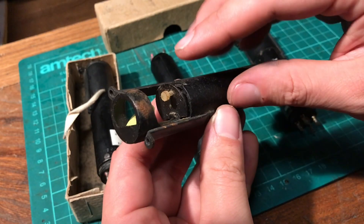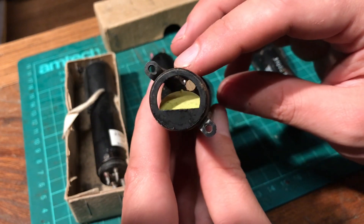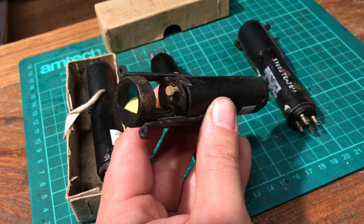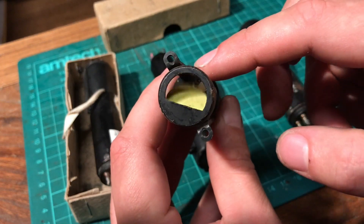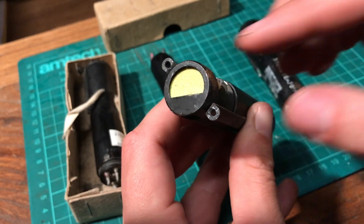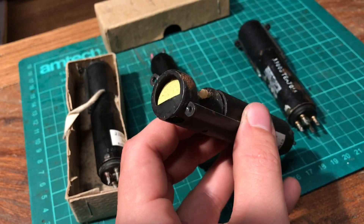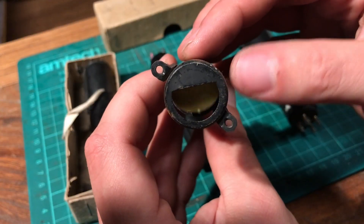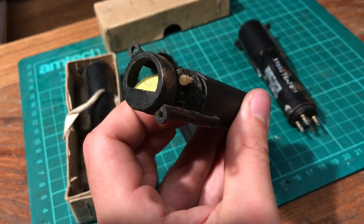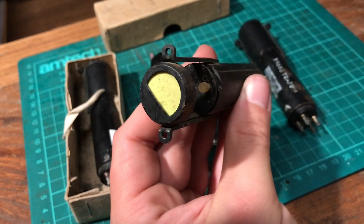So what does it do? This one is partially deconstructed. If I move this little bit, you'll see - it looks just like one of them flip dots, doesn't it? Except these were used in the 1930s, so they're 1930s flip dots. Now actually it's called the supervisory flap. The supervisor was the telephone operator, the telephonist who was in charge of the manual switchboard. These indicators tell you when there's a call in progress. They didn't work with a finger - they worked automatically with the electronic terminals on the back, switching themselves electromechanically.